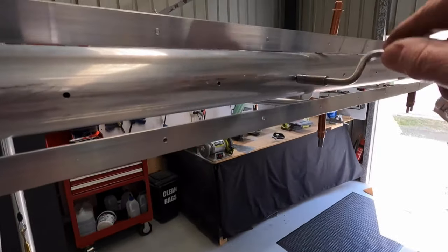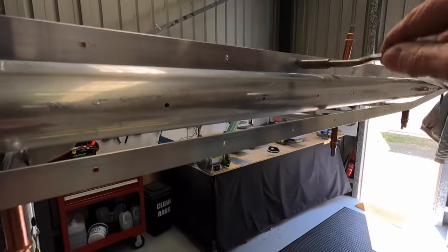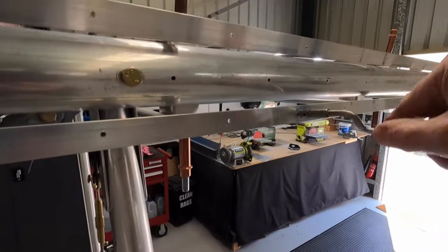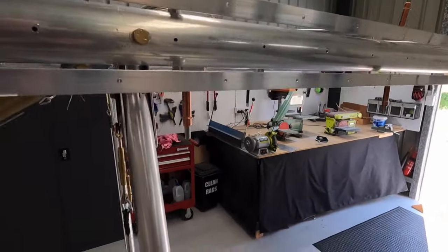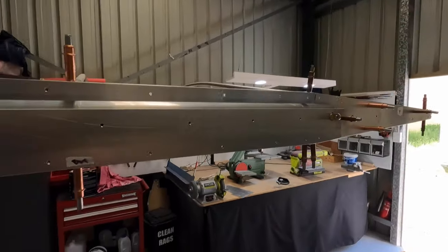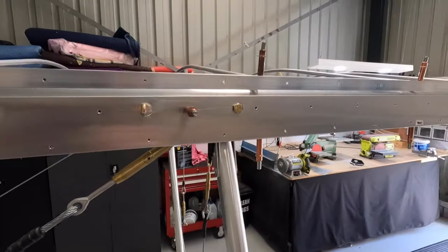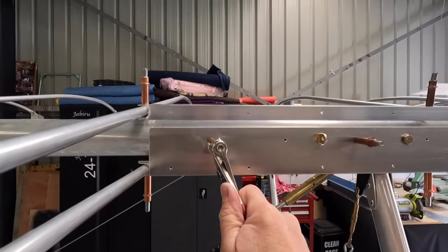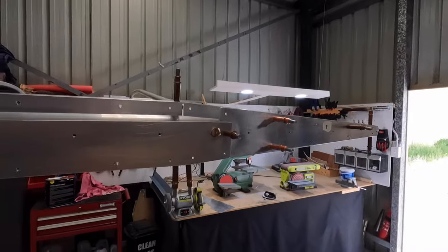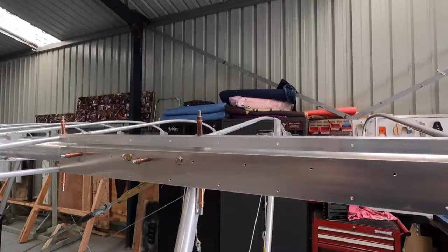This is what takes the time. Deburr every hole, both sides, every part. All right, this is the fun bit. So all the parts have been cleaned up and polished and deburred, whack it back on. Everything just slots together nicely and ready to rivet. All the hard work pays off and the rivets are just the cream on the top.